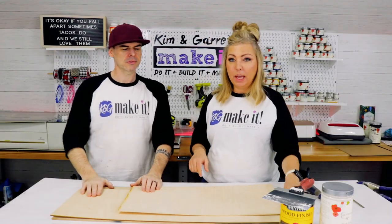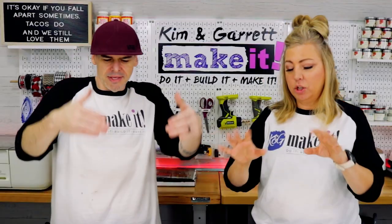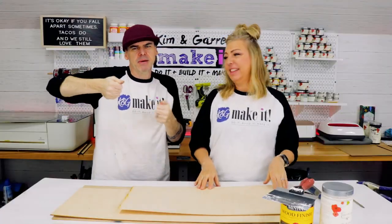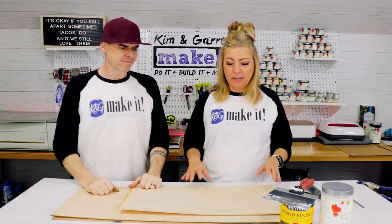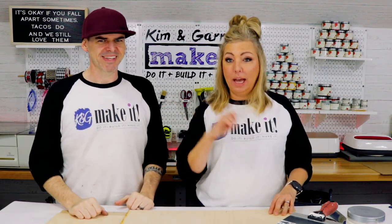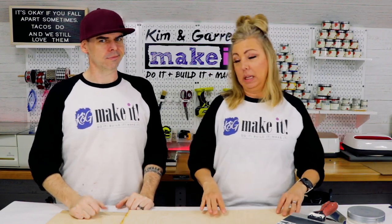We're going to use some MDF and a backer and we're going to layer a little tiny frame. You'll see, I'll show you. It's a backer, a frame, an overlay, and then a frame. Kind of encapsulate the mirror. We're just gonna tuck it in there nice and tight. Don't actually wanna glue the mirror. Gonna glue all the frame around. That was our lesson learned from the last mirror project. We added liquid nails to the back of it and it ate through and kind of messed them up at the end.